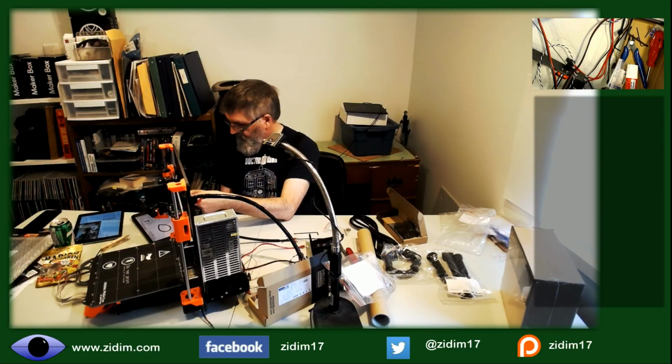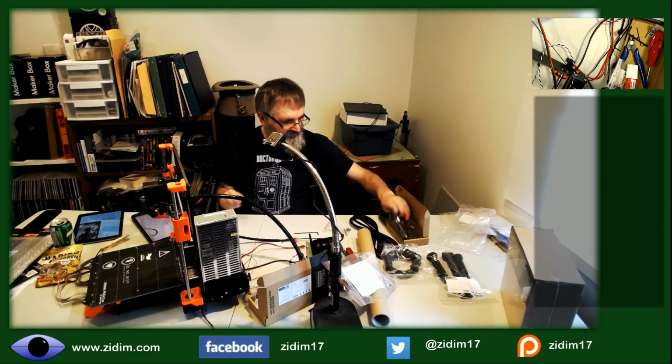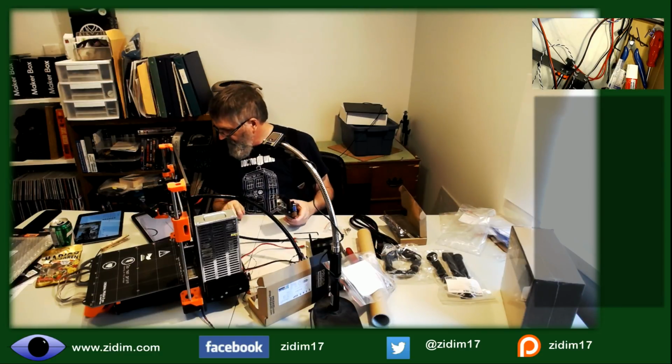And there's a note here, there's different versions of the NC board. The difference is, in one version, the LCD cables connect directly to the board, and in the other one, there's a daughter board for them. So the wrap is done. So let's take a look at our board. That being a daughter board, I have version A.